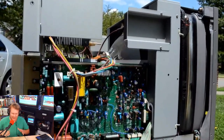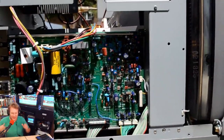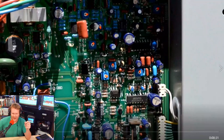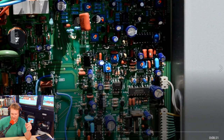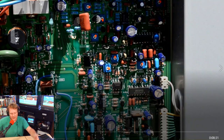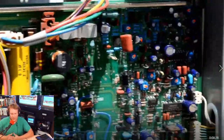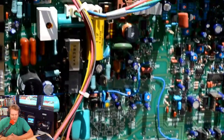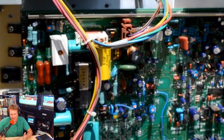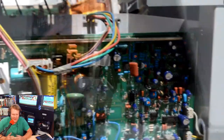This 20-inch monitor weighed almost 90 pounds — very heavy, very thick, heavy-duty. Here is the deflection board. You'll see a lot of these little potentiometers on here — this one's for horizontal hold, and there are side pin cushion adjustments. Not only do you get to make adjustments with the pull-out board, you can also adjust directly on this board through these potentiometers. If you have any issues with deflection, you can go in and recap this board. I did test some caps — they look to be in great shape, so we're not going to add the extra expense of recapping at this time.